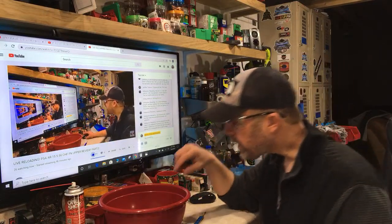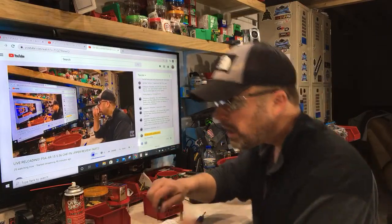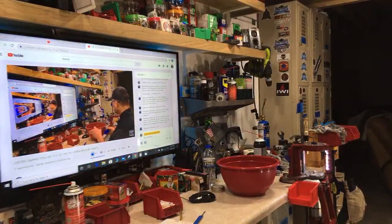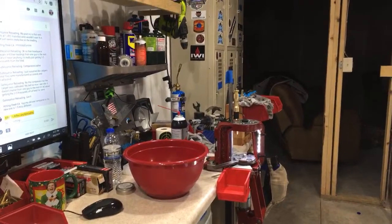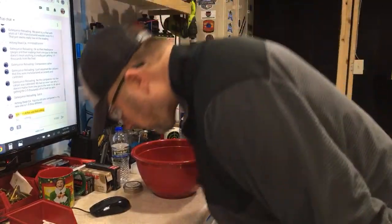So I think this lube has been sitting around long enough, and we'll get this set off to the side. Keep that in your mind: headspace gauges, bump gauges, they don't read the exact headspace. They'll read it really, really close, don't get me wrong, but they don't read it perfectly. All they do is tell you that you bumped the brass. That is literally it. All right,